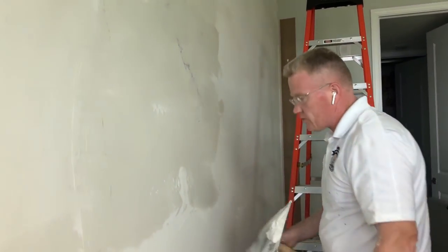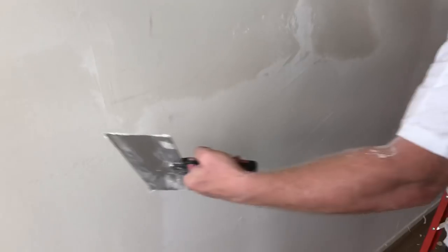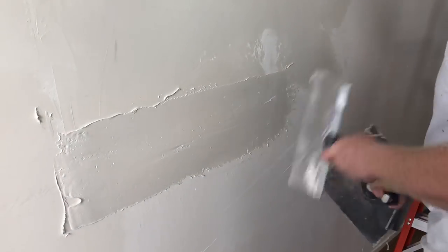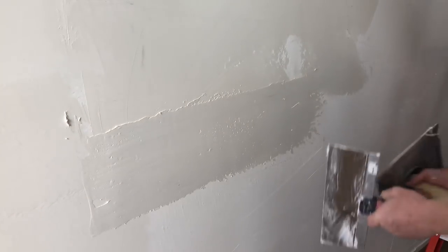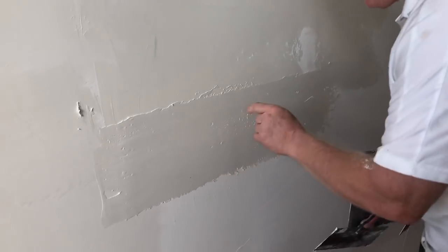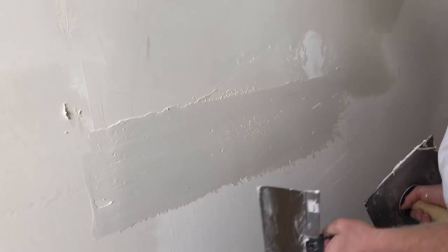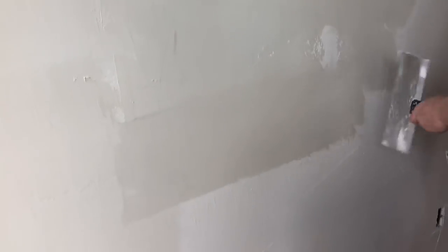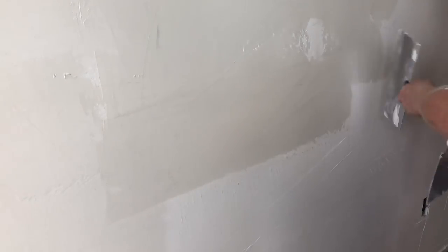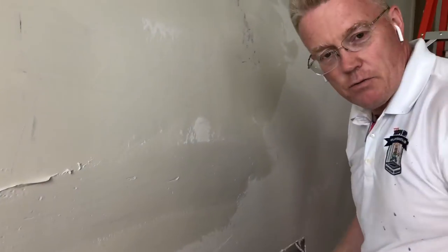That's good in theory, but let's see it practically. I'll do the sweeping motion with the blade. Now watch — if I don't put enough pressure on the blade, look at that. That's 90% of new people who do plaster work. This would have to get sanded, it would have to get filled in. Now watch what happens if you put too much pressure — look at the angle, because this is going to make you take it all off. At 90 degrees, that takes everything off. Half of 90 is 45; about 30 degrees is roughly right. If I drag it too tightly against the wall, I now need a third coat. This is where what's called finesse comes in.